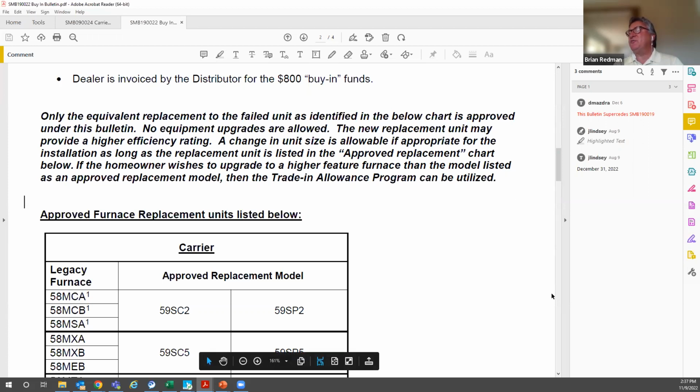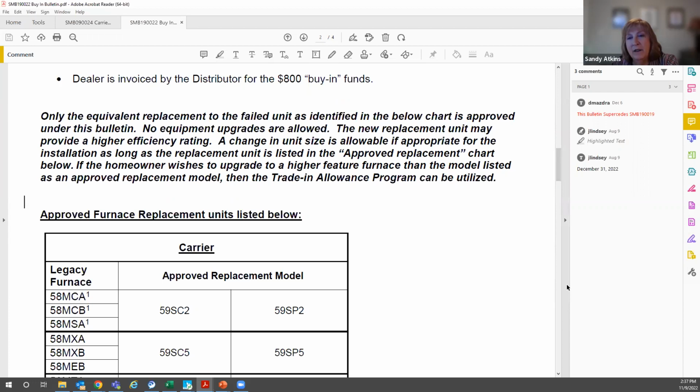024A parts only. Did you say this will cover the baffles, etc. also? No, well, it does say on there that it will cover a cold spot baffle on that bulletin. I've not seen anybody buy those in so long that I didn't even mention that, but it says failure required replacement of secondary heat exchanger and the following related parts: coupling box kits, cold spot baffle, and cell inlet and outlet panels. That's what the bulletin covers. So yes, it does cover a cold spot baffle.